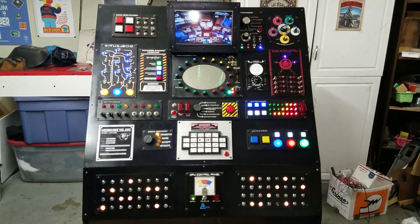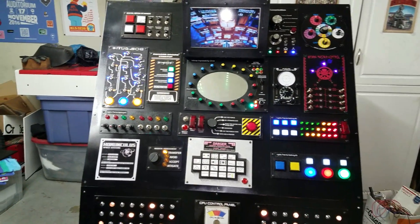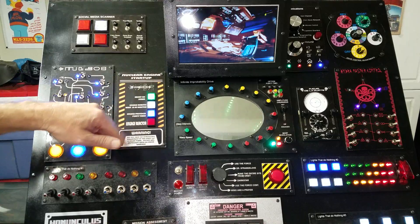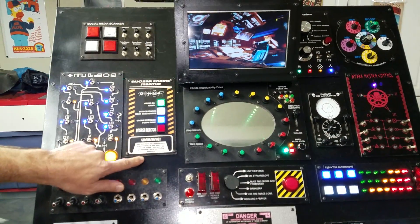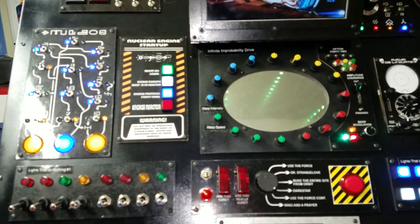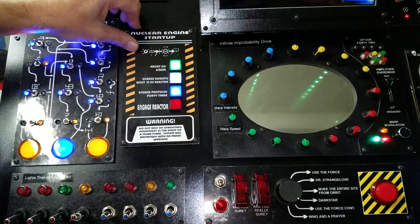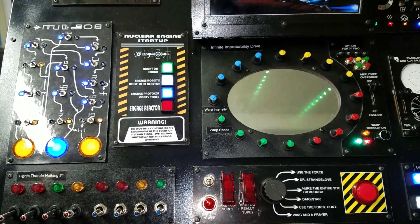We'll just go through each panel and see what the features are and what it does and what it doesn't do. The panels themselves are laser cut MDF. I drew the panel in CorelDRAW for the visual, and then drew another layer inside CorelDRAW for the actual cuts for the holes. I use a CO2 laser cutter to cut the panel in MDF, then I print out the panel and glue it on. It's not just printer paper — it also has a protective clear coat on it as well. It took a long time to figure out the process, but I finally worked it out.